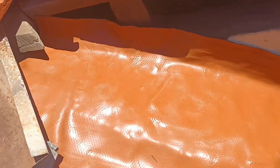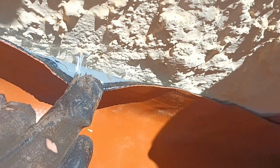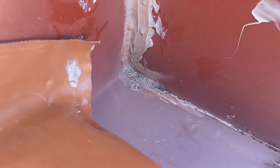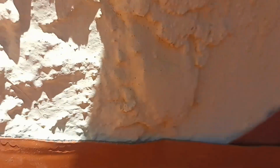It's a lead substitute, but what it does is it keeps the water above the tiles, so we don't have anything dropping under it. We've got the little lip there, which is going to stop anything going on. Now this has a sticky edge. Can you see that sticky edge there? So it sticks to the wall, and there's that as well on the bottom here. So it actually adheres to the tiles, and it's going to run it down and into the gutter there, which is then going to take it away. Now we'll put a small cover flashing on that, just so we can seal it to the wall. It doesn't help the type of wall this is, but that's what we'll do, and that'll just finish it off.